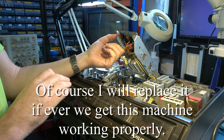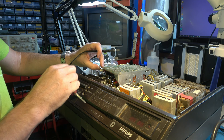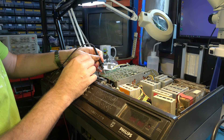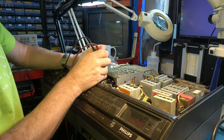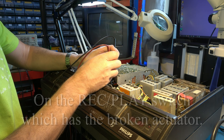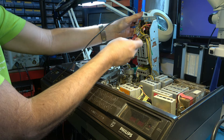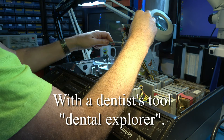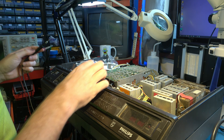I need to make sure it's in the play position, which is forward. I need to push it from something behind to make sure it's fully forward. I don't ever want to record on it, so I'm not that fussed about that. But I do need that switch in the right place. I could check it with a meter. The switch is at the back, so it's in the record position - I need to bring that lever forward somehow. All the spring and collar is missing from this switch. The record switch is now in the disabled position - I'll leave it like that for the time being.